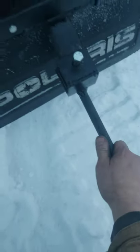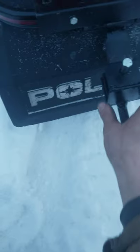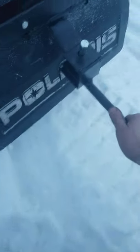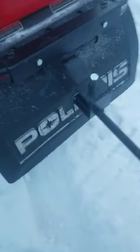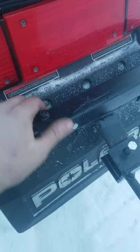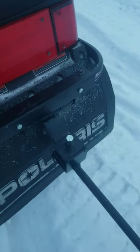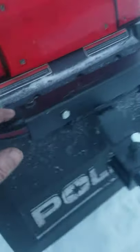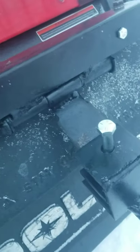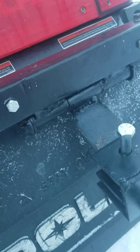That same piece of stock continues — it's all one piece solid bar going into my hinge. I ended up doing my own hinge: this piece of C-channel, with two bolts that go right through and pinch the C-channel. This actually goes through the bar for the snowmobile, and so does the other one. I made up my own hinge with some solid bar, some round tubing around half-inch.